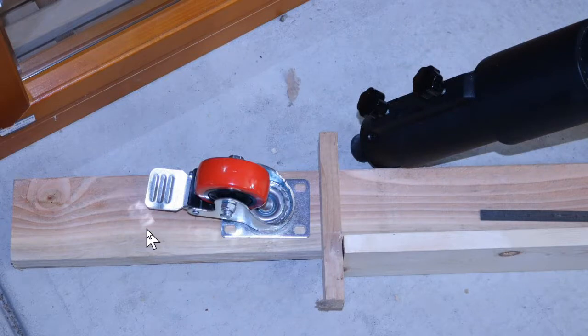Now, the next thing — don't move these boards. Keep them all carefully where they are, touching the sides of the tripod legs and with their points together under the center brace. Remember, this board is perpendicular to the 2x4. If you can hold it in place, butt two pieces of 1x4 on this side, because you're going to measure and cut the 1x2 so that it goes from the outer edge of one 1x4, across the 2x4, to the outer edge of the other 1x4. Go ahead and cut three of these — there's one on each of the dolly legs. This piece needs to be in its original position and on its marked lines with one inch clearance.